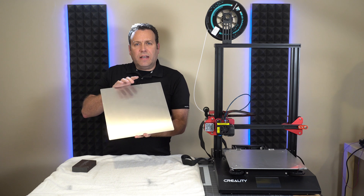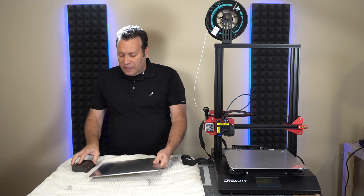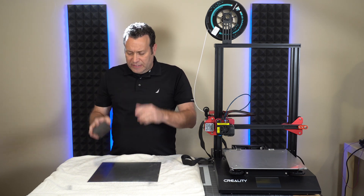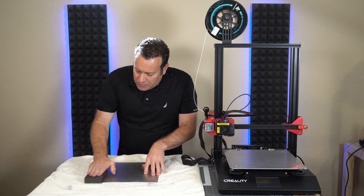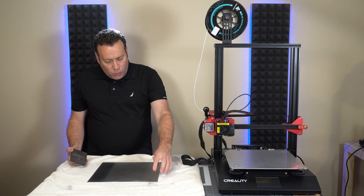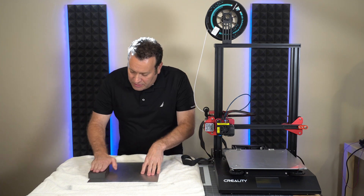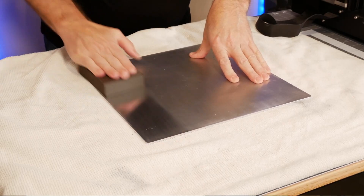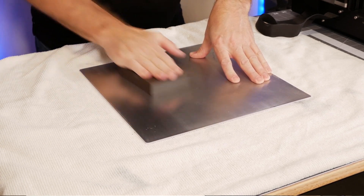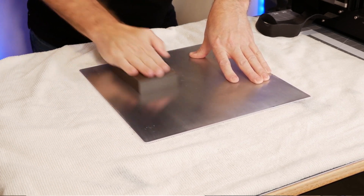Our build plate on the side with the textured adhesive actually looks pretty good and doesn't need much prep. But the back side does, so we're just going to hit it with a sanding block — I'll put a link in the description for the grit that works out really nicely. We're going to give it straight back and forth, nice even strokes, mostly concentrating on the corners and the areas where we were getting a little cutting on the actual heat bed. Just nice and straight back and forth, work your way across, and basically clean up the surface to get a nice even texture all the way across.